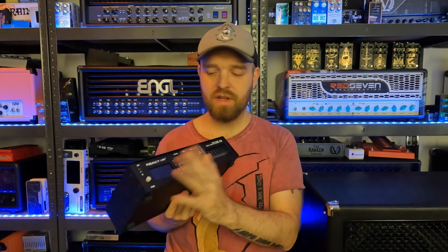Over here we have an aux in. You can put anything in there, you know, like an MP3 player or whatever. Then we have the return of the effects loop, left and right, so there is a stereo loop. Then we have the main outs XLR. And then we have the throughout. This is where you put your amplifier in. And this is the attenuator out. Then we have a ground lift switch for the main outs. MIDI in, so you can control this with MIDI for if you're going to use this in your rack for a live show and such. USB, foot switch, so that's cool that you can use it with a foot switch. And then a pad for the send or DI out, and a ground lift as well.